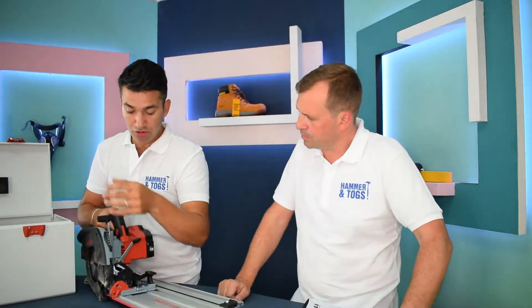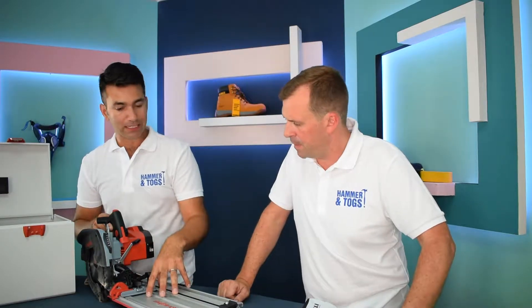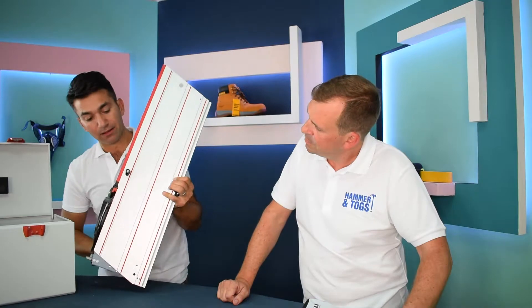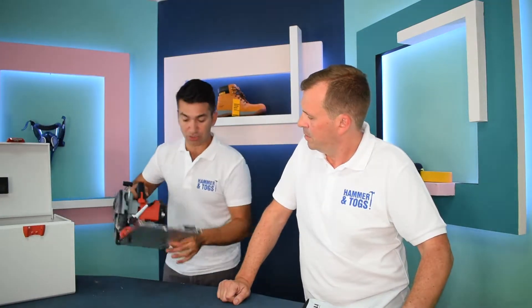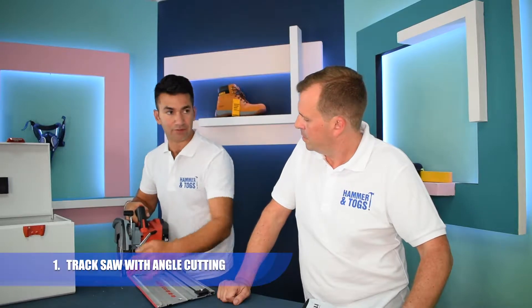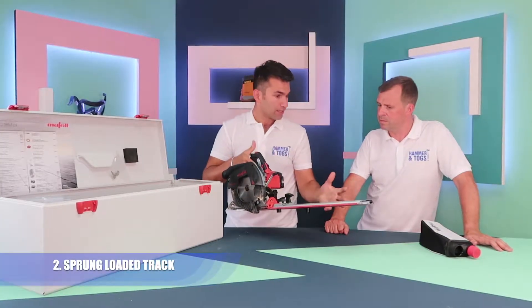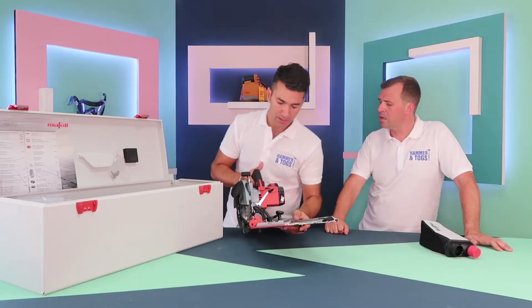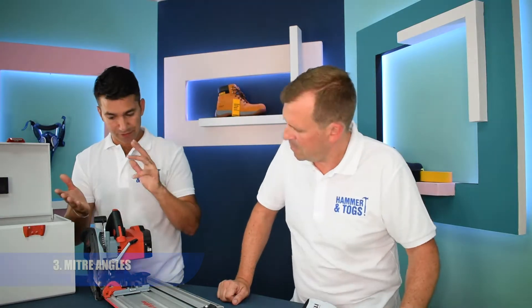So like before with crosscutters, it uses a track — you can use a guide track. You can do your miters with it, so it's got a noggin on the back there. You can adjust this noggin and then when you push it against something you can get your 45-degree angle. This is a spring-loaded track so it comes back to you. You've got depth of angles so you can do your miters left and right.